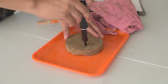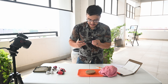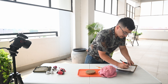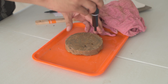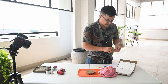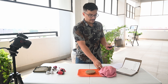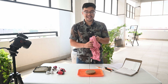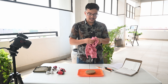It's important to not get too close to the first location. This was a little bit stiffer, about 3.7. And again, 3.7. It's often good practice to clean your penetrometer after each use. I didn't do that here because it didn't collect too much debris, but if you see that it's picking up a lot of debris, make sure that you clean it off before using it again.